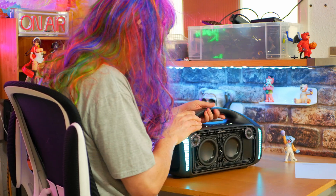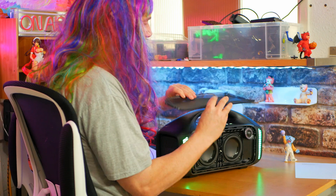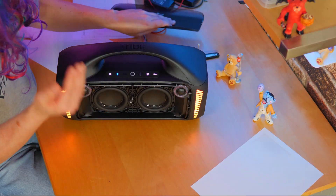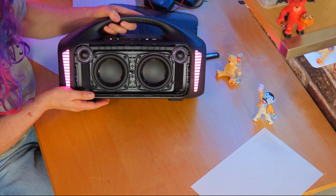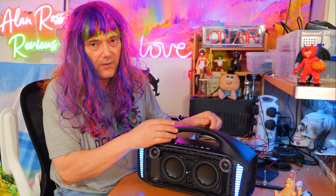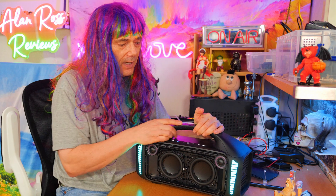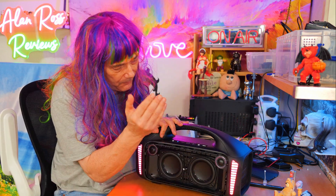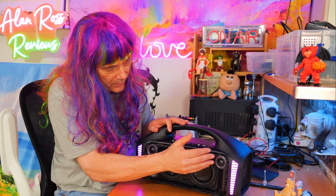So I have taken it apart, which I don't normally do because I do tend to mess them up really, really bad. And that means if I come and review it now I'm gonna have to say you'll have to stick the grill on. That's me not being a DIY - I don't take the time to take it all apart so it all comes away nicely. I just went 'dun dun dun dun', get the grill off. So what did I find out? Let me explain to you - I've looked at what the crossover is going to be, I've looked at what just the woofers are doing, what just the tweeters are doing. And so I'm doing these clearly near-field measurements to get rid of all the other influences when it comes to diffraction and problems with baffle and stuff like that.